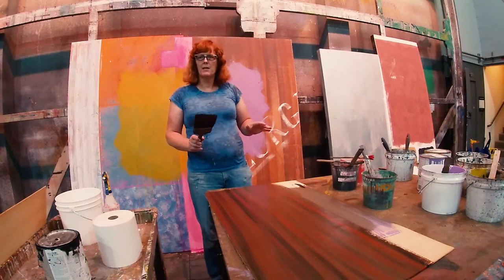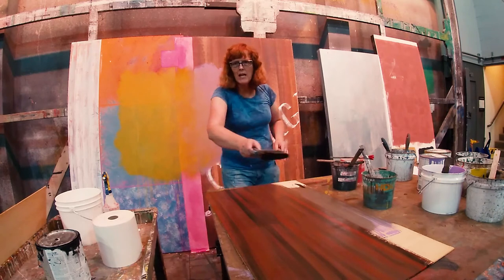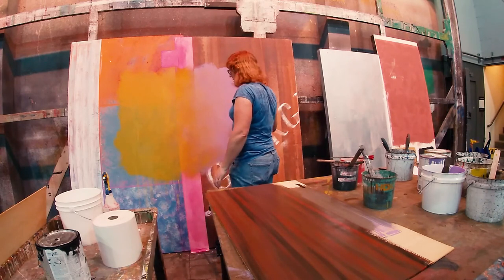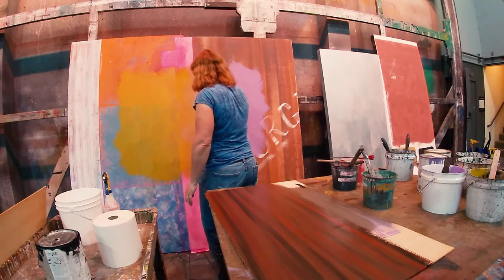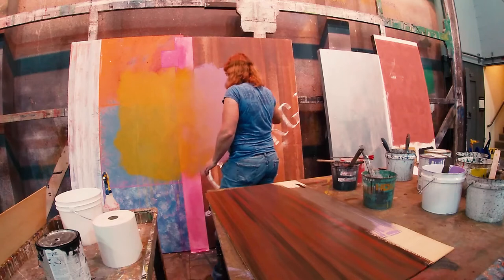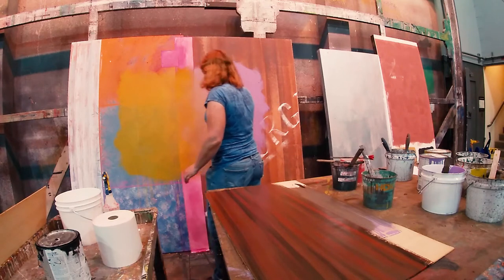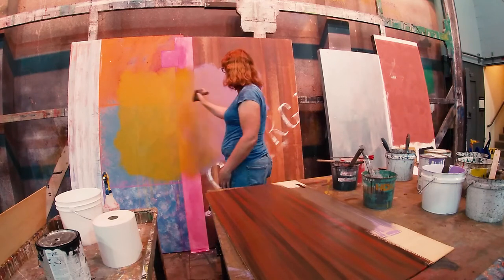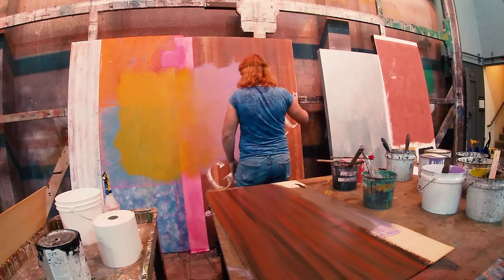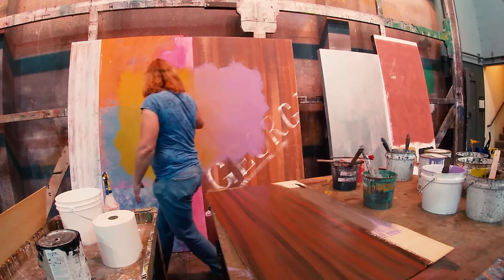And as we're doing this, I'm doing top to bottom and pulling it back. If I'm working on a horizontal surface like this, I want to keep my hand movement going horizontally and consistent. And the best way to do that is not to sweep your arm and not to rotate your torso, but to walk and keep your arm in place.